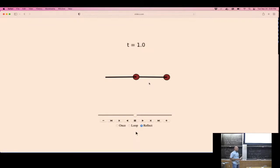I see. So I think the question is, what math tells me that I can't go out there, beyond the reach of the robot? This is still telling me. Also, if I commanded in this direction, it will fail, right? And similarly, if I'm at the edge of some workspace and I'm trying to go farther, this is what happens: you command yourself to go farther than you should, and your arm goes straight, and the robot goes crazy. So the math does tell you that in both directions, and it's very much a differential quantity. It's only telling you, as a function of this, which directions can I move. It's not an absolute workspace analysis. It's just instantaneously, can I move in that direction?